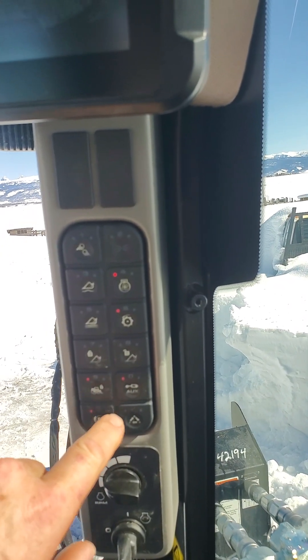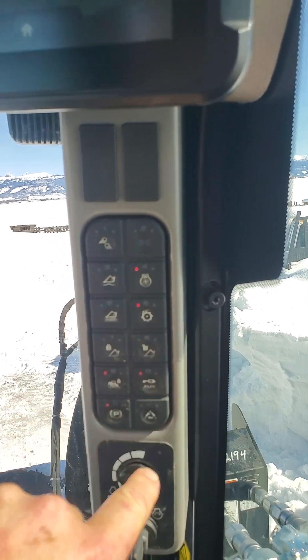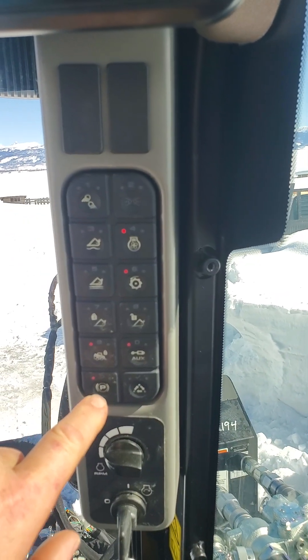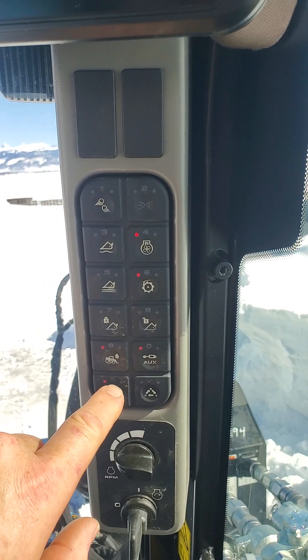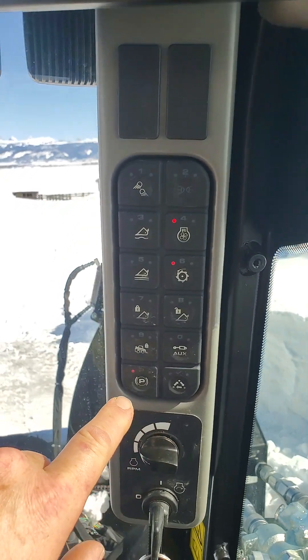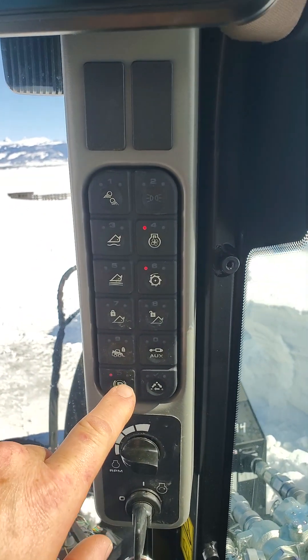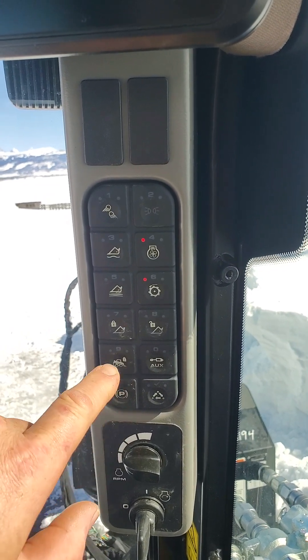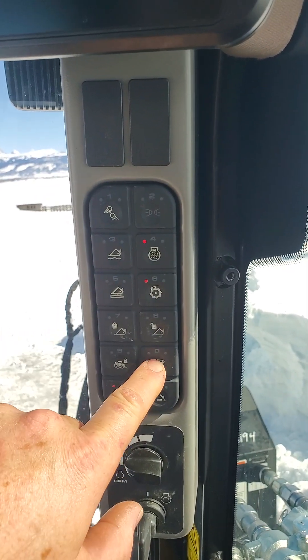But the next thing you need to do is turn this off. You can't turn that off with your auxiliary hydraulics unless your controls are unlocked. You can leave your park brake on, but usually I just turn them both off. High flow is on, auxiliary is off.